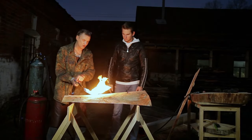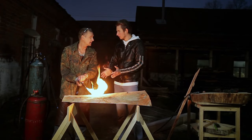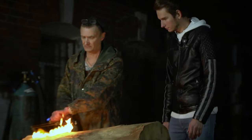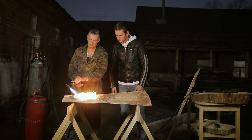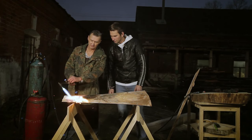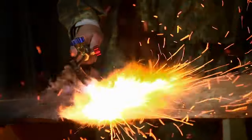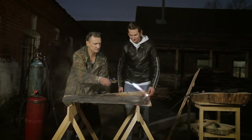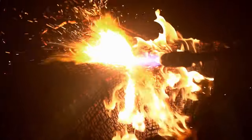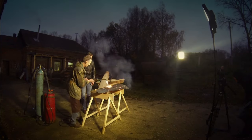We've turned on the gas now. Now we turn on the oxygen — this is blow down, that's the same oxygen yet it's under high pressure. That's a device for metal cutting, yet we're going to burn wood. A metal cutting device, also called an autogenous welder, was developed to burn metal by a current of chemically pure oxygen. The temperature in the cutting area is over 1,000 degrees Celsius. If we replace metal by wood, its soft layers burn out almost instantaneously, while hard resinous layers have time only to char a bit.